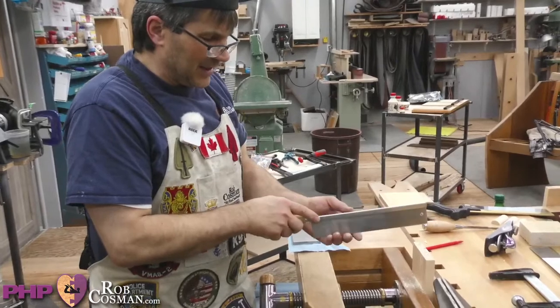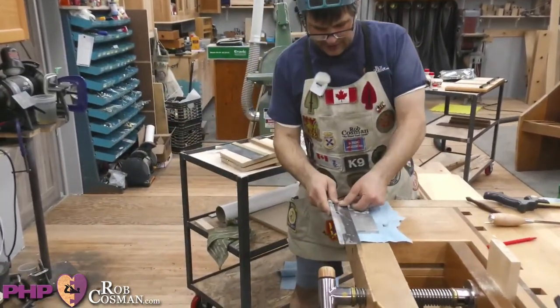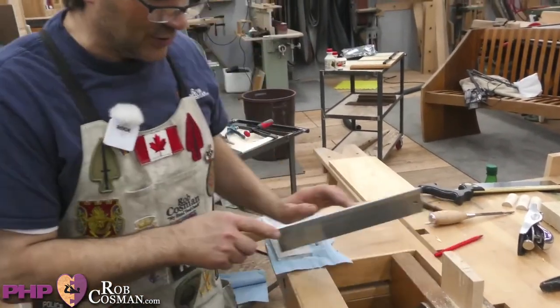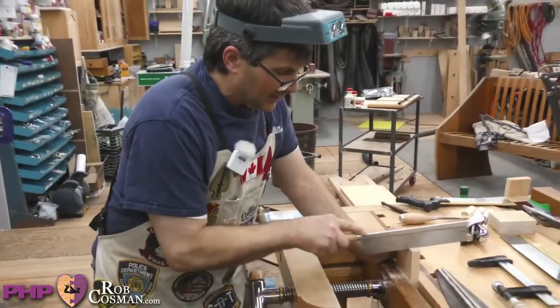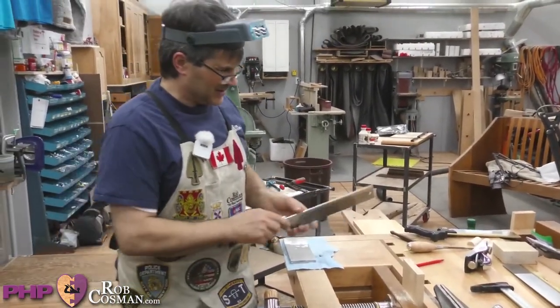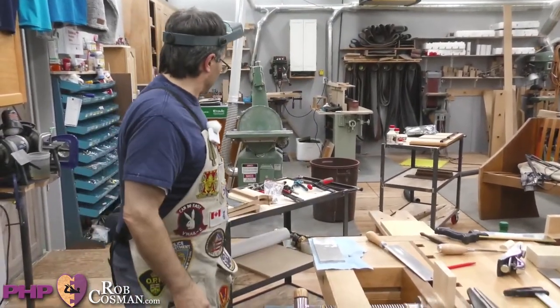So if that were the case, and I'd say, okay, I've got too much set on this side, I would come over here and do another stroke. Come in and try it. If it's corrected, great. If it isn't corrected, I've got to do it one more time. Sometimes you go too far. How do you know when you've gone too far? Well, you can't saw. It just gets stuck in there. It's jammed. Then you've got to go back and redo your set again. But it's not something you can't recover from if you don't get it right the first time.